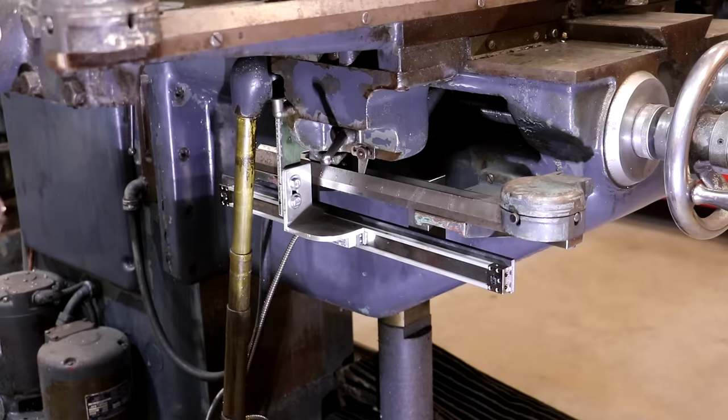The half function — if I move my axis out to some position and come in here and hit the half function, then select the axis, it divides that distance in half. Now I can take the axis back to zero, and it'll start beeping when I get close to my number. We're two-tenths off — it'll take a little while to get that zeroed out exactly — but you can see how easily I can find halfway between two points, which is a nice feature to have.